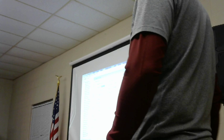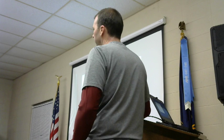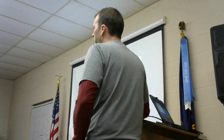James, I got a question. Yeah, go ahead, Rodney. You were talking about the TOT, the timeout. Do DMR repeaters time out the same way analog repeaters do? If you talk too long, will it eventually just cut off? If they're set up that way, yeah. It's just like an analog repeater. You don't have to have a timeout timer, but they're all defaulted to 100. All of ours are 180 seconds.